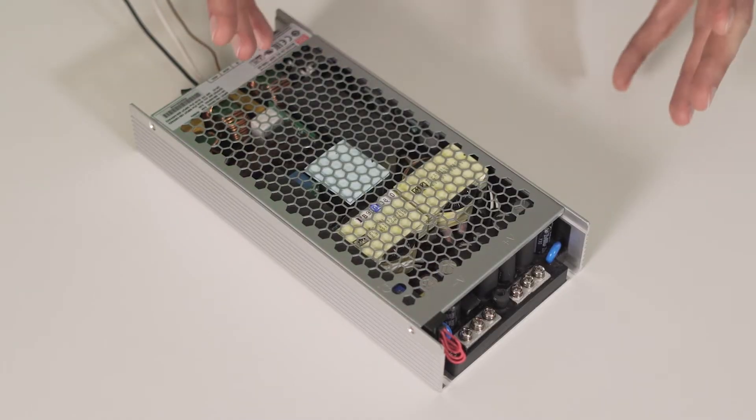The result is that these can be conduction-cooled, mounted on a baseplate or heatsink that draws heat away from the unit, and free air surrounding them will help as well with convection cooling.